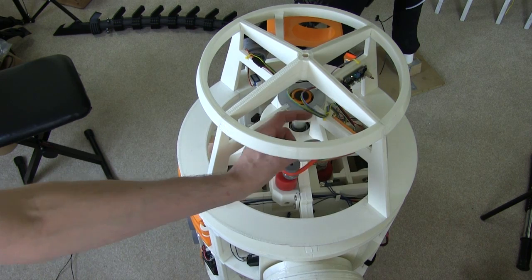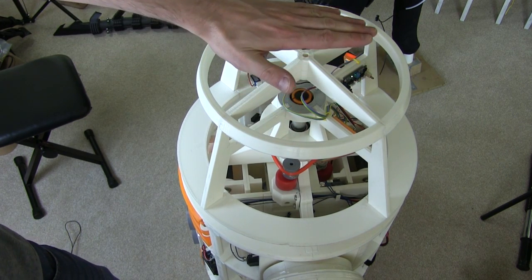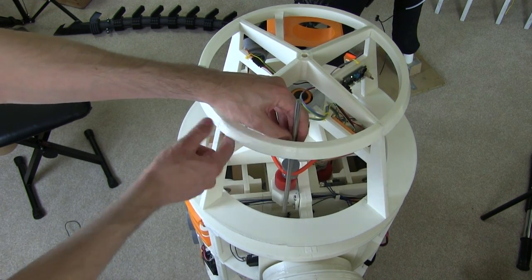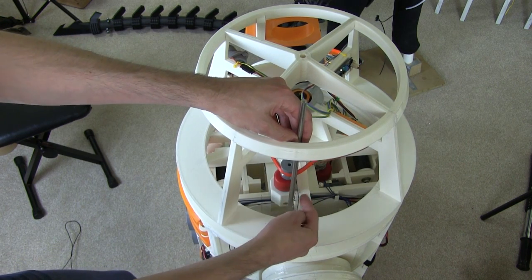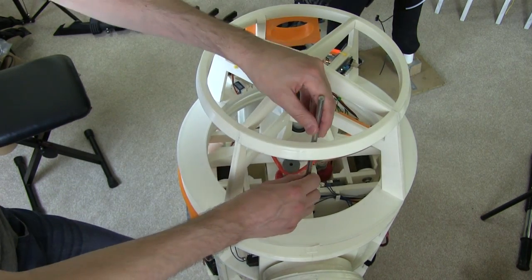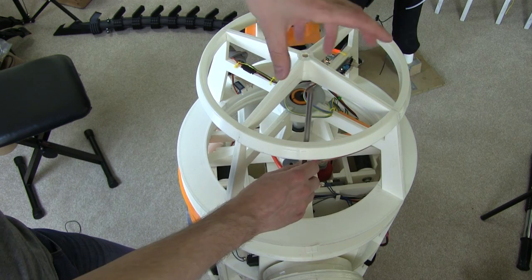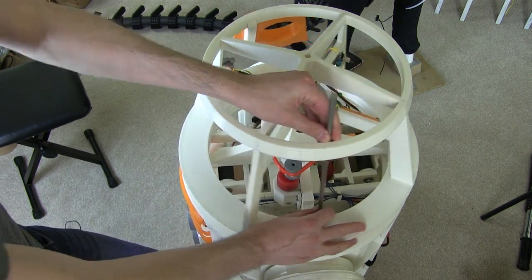Any linear lifting thing has basically got to lift past this motor. The motor is conveniently in the middle so the periscope itself, which is about as big as my fist, can raise up - it needs to go maybe 15 centimeters high. The plan is to use a piece of 8mm stainless steel bar fixed to the head, so as it spins it needs to avoid that motor. That can have linear bearings that go up and down with a pulley system - a pulley at each end with a tooth belt driven to slide up the periscope lifter, with the bulk of the periscope sitting above the motor.